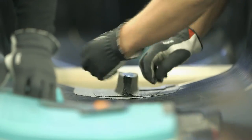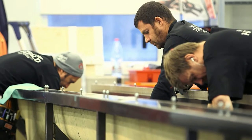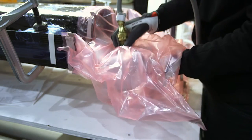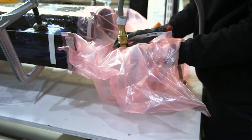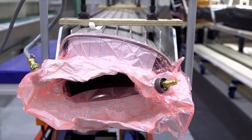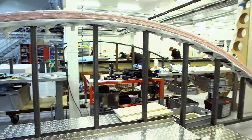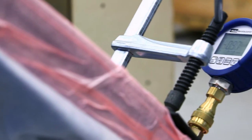If you look around you'll see some molds here — they give us the shape of the boat. First the layers are put against the mold and they have to be pressurized with a vacuum bag, which holds them in place while we put the sandwich material in. Then we put the other layers on top of the sandwich and that's all held together with a vacuum bag — basically a plastic bag over it — and we suck all the air out with a vacuum pump.